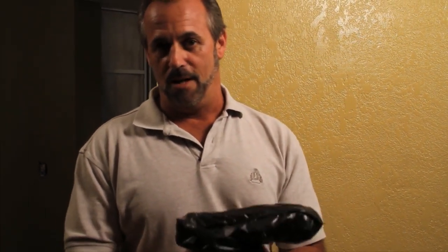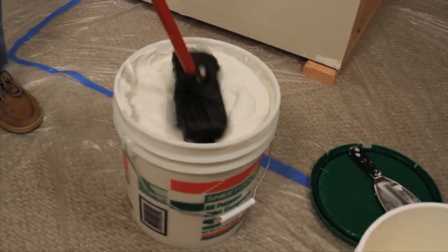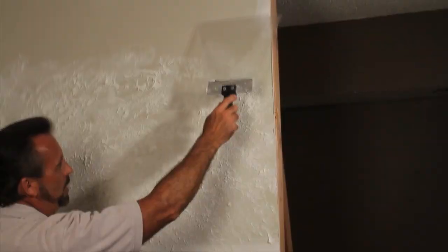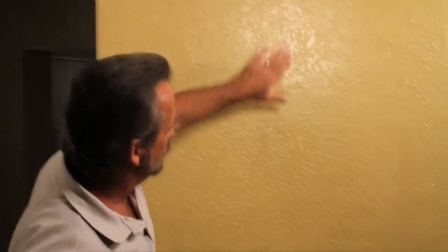You're going to use your drywall mud — take the lid off the bucket, put the tool into the bucket, then put it on the wall. The drywall mud will stick to the plastic applicator, and when it hits the wall that will pull it off the wall. Then you'll take the Lexan blade and knock it down smooth, which gives you the texture. Very little prep work: sponge, sand it, paint it, and you're done.